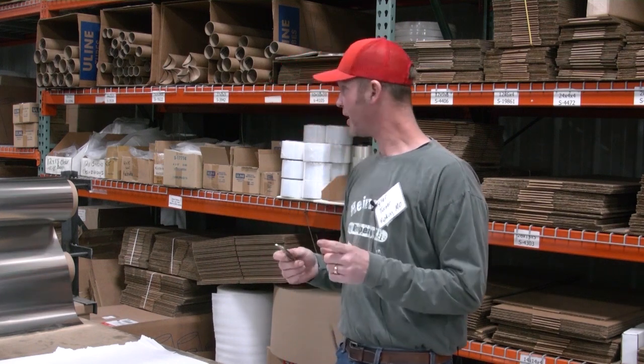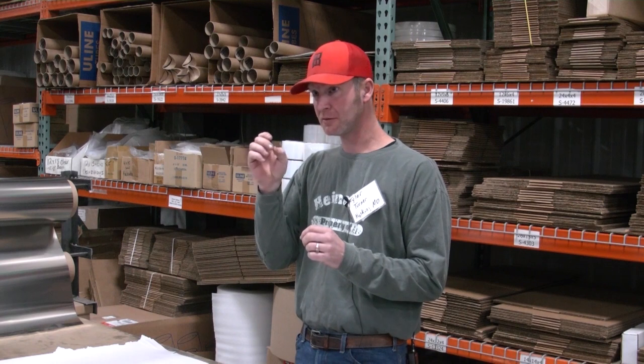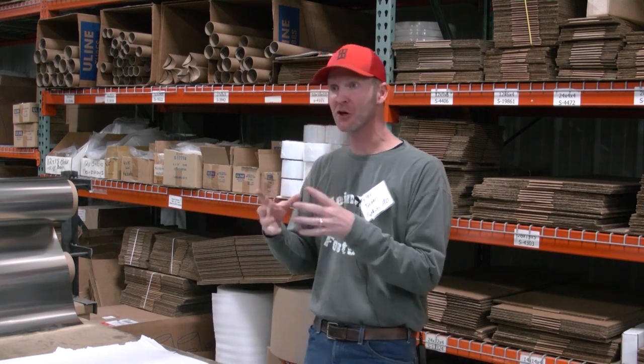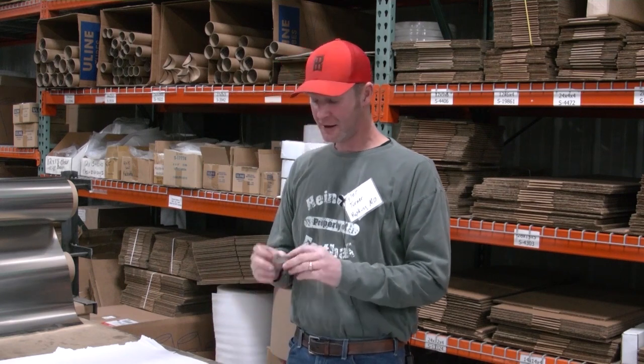Okay. If you run into any trouble with it not seating good, and you don't feel like it's grabbing well, stake it. Go in with a micro nail punch, and you'll stake that around that ball, and you'll swell that, you know what I mean? Go in there with a little small center punch, and you can stake that, and that will ensure that material's forming around that, and you won't have any trouble with that ever falling out. Yeah, because you're past center, so there's a little gap, a micro gap that you can stake, and that leads me to another good point.